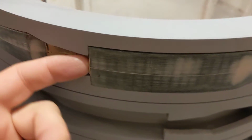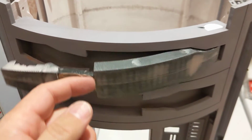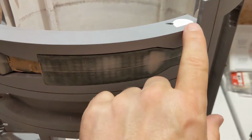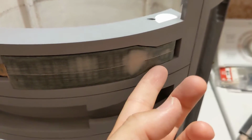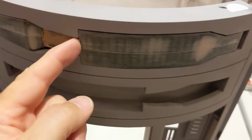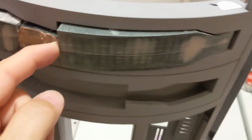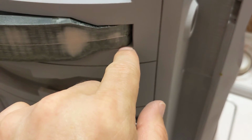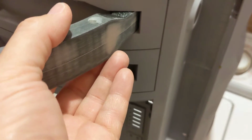with one hand once I got it out, but as you can hear on this one, it's rubbing. And this one likewise, I had to make the pin a bit smaller, and I was able to take the 15/64 drill bit and drill through the top. So this one is in, but if I lift up on the arm, it fits kind of sort of with no rubbing. So I believe I need a little tiny thin shim washer to go underneath here, which I don't know if I'm going to be able to get one that's small enough to do that, but I hope so.